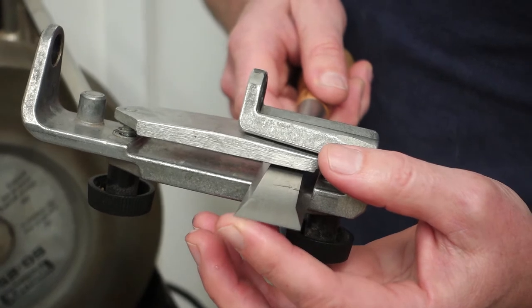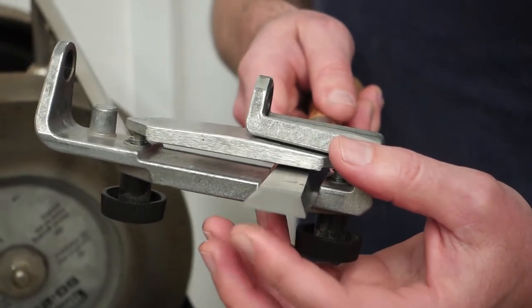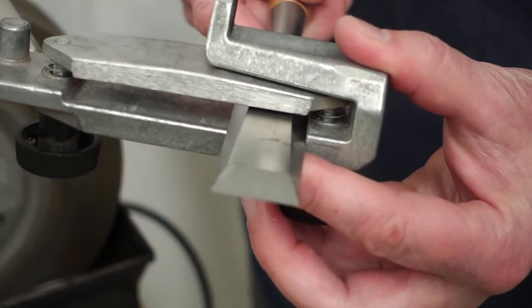Also, just very gently run your finger along the back of the tool. When you can feel a very fine hairline burr, that means that you have abraded and polished right to the edge of the edge tool. And that is the time to move on to the next step.